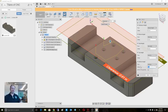Now it's 1/4, so it's a 201, and is the chamfer called out on that particular one? I don't see a specified chamfer, so we're going to go with that 10 thou. The math on that: 201 divided by 2 plus 10, so I want it to go negative 105, let's go 106. That's 105.5, right? So negative 106 from the whole top. So that's our spot and chamfer.